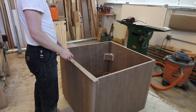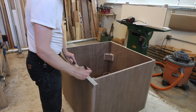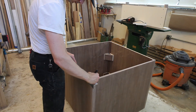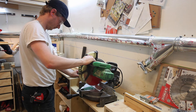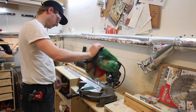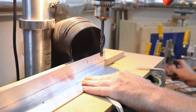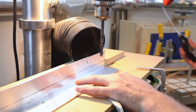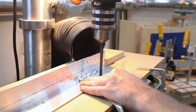To fasten the base and the top together, I'm using 1/8-inch aluminum angle. I chose aluminum because it's not really adding any structure — it's just there to hold everything together. It's also easy to work with: I've got to make some slots in it for wood movement, and I've also got to cut it up and drill it out. I really didn't want to use iron; that would just be too much of a bear for my shop.